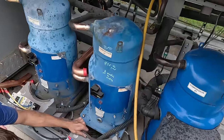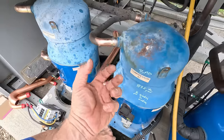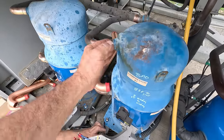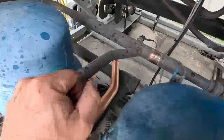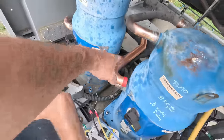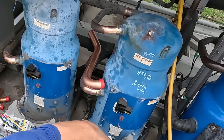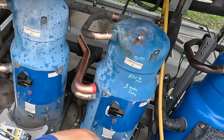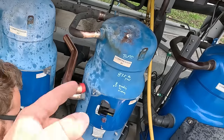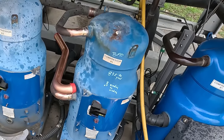So what we're going to do is go ahead and cut this pipe right off the compressor so we can get this out. We're going to use a bandsaw on this right now. The shavings are not going to get into the system because we're going to cut it back here with a pipe cutter once we've got these units out of it so we can piece them up. I'm going to break the rules a little bit with a cutting-type device, but trying to get a pipe cutter in there that's big enough is not going to happen — at least not with anything I've got.